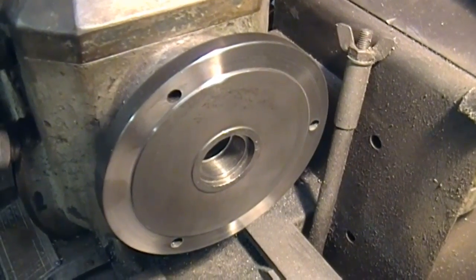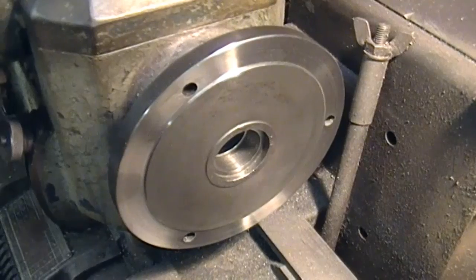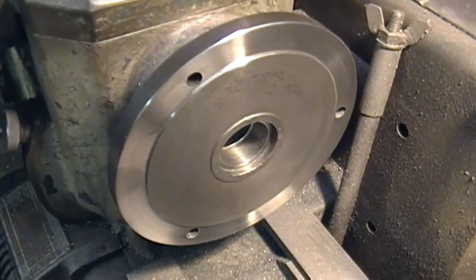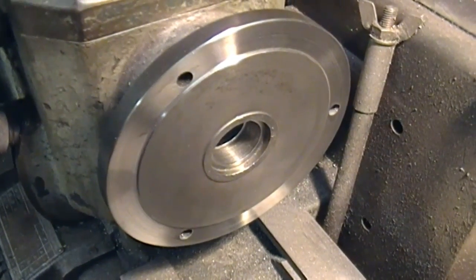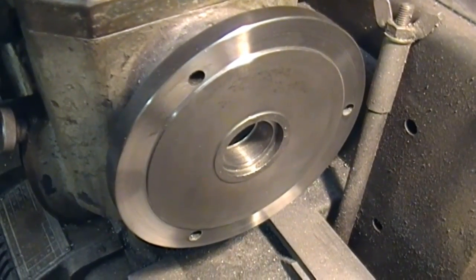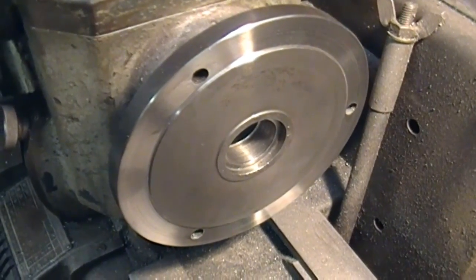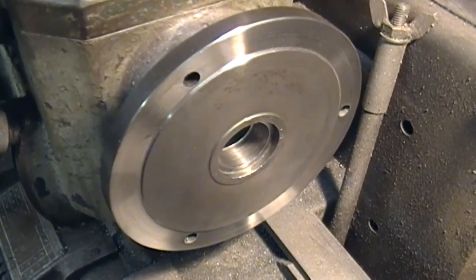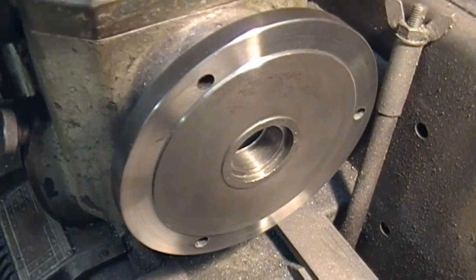I've made a further decision on the back plate of the three-jaw chuck — I've turned a register on it. That damn hard cast iron dulls the tools pretty quick, but even on small cuts I got it to a very tight tolerance. So I'm going to put the chuck body back on and see how it works out. I'm still expecting trouble with the jaws closing inconsistently.